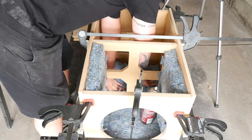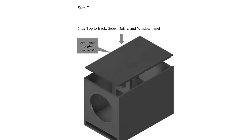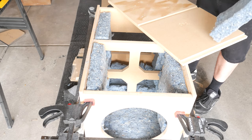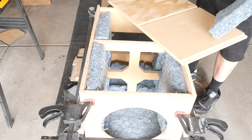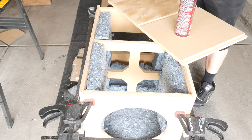The reason we are doing this is to prevent any excessive resonance. Step seven: glue top to back, sides, baffle, and window panel. Here I am spraying the back of the top panel to apply the last of the denim insulation. Make sure the insulation is cut evenly so it doesn't affect the placement of the top to the rest of the enclosure.